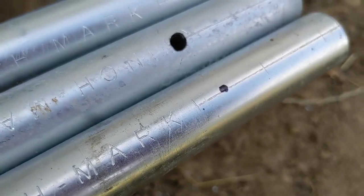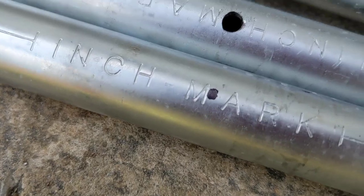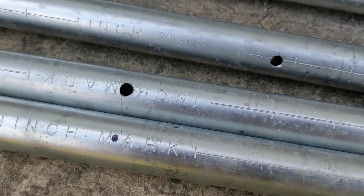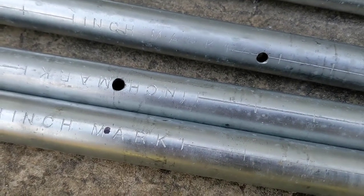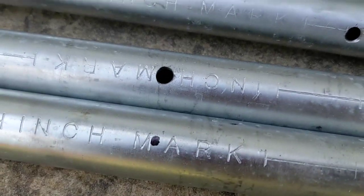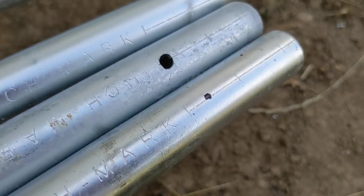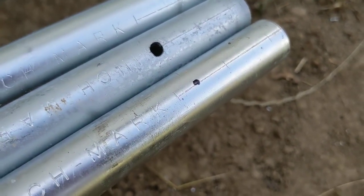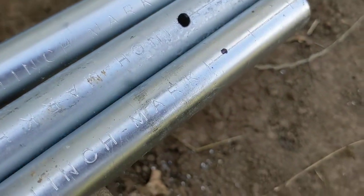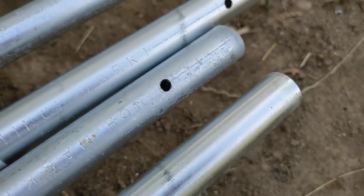If you make your marks on that, not only can you line up the two holes along this score line, so if I come down here you can see my other hole, and what that does is it keeps your two holes that face the cage in line vertically, so you know they're going to be right up against the cage corner there. And it also gives your drill bit a nice little groove to sit in. This way you don't accidentally slide off, because it's really difficult to just drill into a spot on a rounded surface.